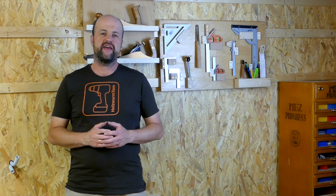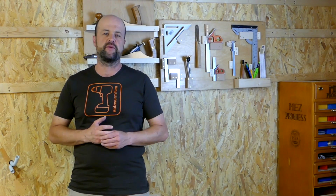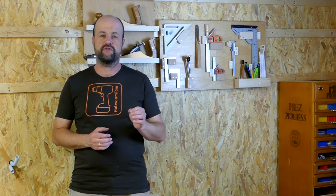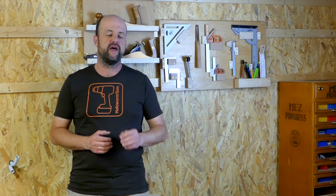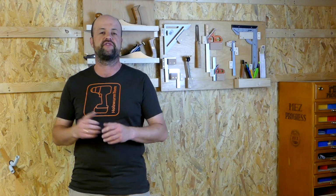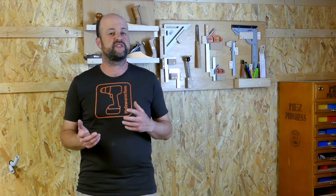In this video I extended the tool wall that I started building in my workshop a couple of years ago, and the first thing I had to learn was: don't assume things, check them. I had bought the OSB sheets, by the same dimensions, I thought, in the same hardware store that I got the old ones a couple of years ago, and I had assumed that they were the same length, the same width. Well, they were the same width, but they weren't the same height or the same length.